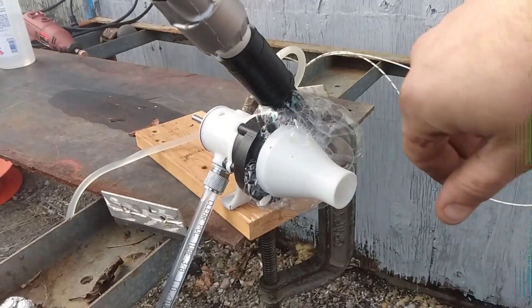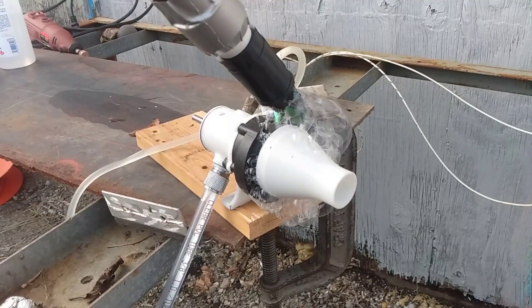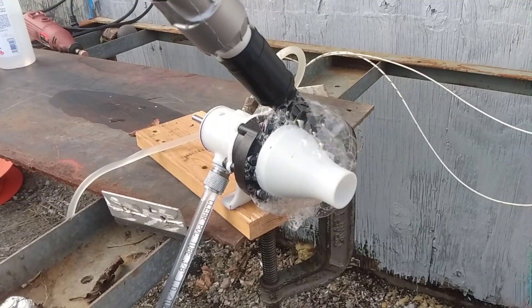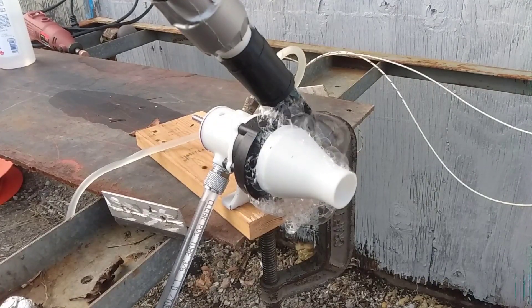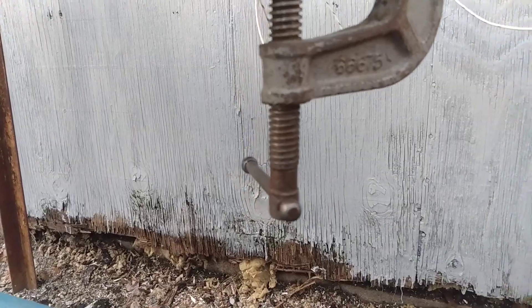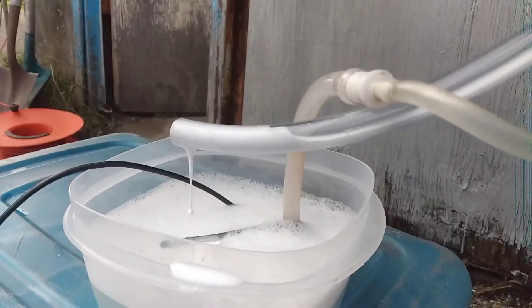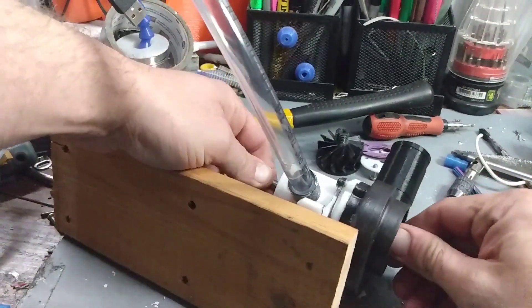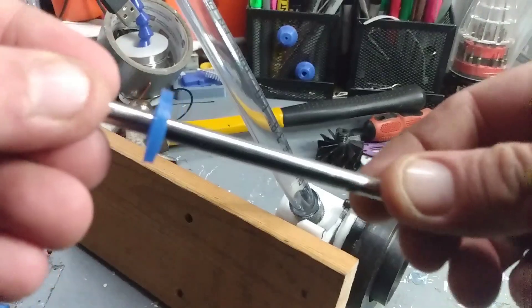As you probably noticed, there's a spray coming out of the turbine from the soapy water leaking through — I figured this would happen because of the lack of a slinger on that end. I stuck the end cone on just to see if it would change anything, and it made bubbles from the soapy water leaking around the outside. Overall, I ran it for about 30 minutes, but that involved about six different seizing situations and I had to free it up twice with the drill. I'm going to take it apart and enlarge the hole at the back of the housing to eliminate the rubbing, though it will definitely increase leakage.